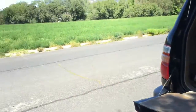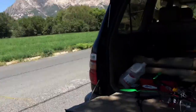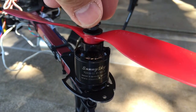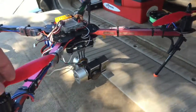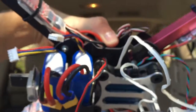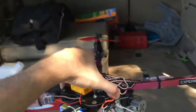This is going to be a test flight here in the grass fields — alfalfa. This is a test of the new setup with sunny skies: 2216, 800KV motors, with 9x4.7 props. I'm planning to head over and pick up some bigger props because I'm pretty sure these are not going to handle all this weight. We've got the gimbal, and I've switched up to a parallel connection, which increased the weight a little bit.